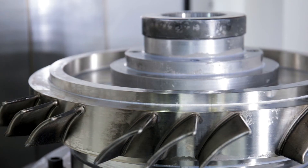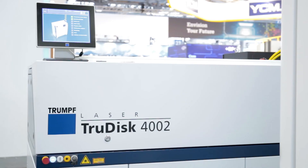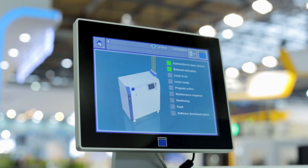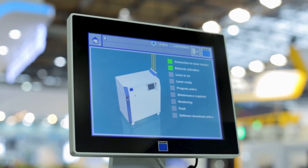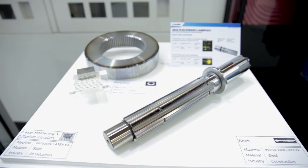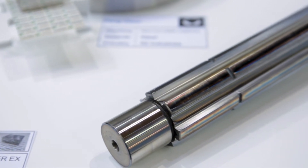They are specialists in pure additive machines, while we are now trying to combine this technology with our conventional machine tools. The laser is a very proven technology called TrueDisk — we have a TrueDisk 4002 here at the show, supplying the two machines. Also the optical head, the laser head, the powder feeding system — all of this is pure Trumpf technology.